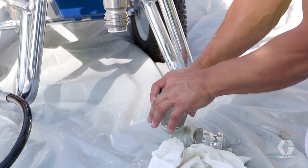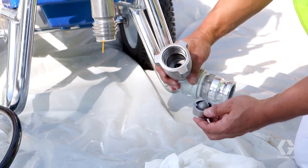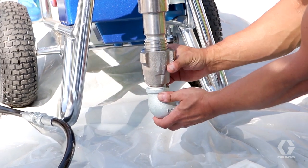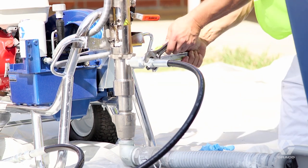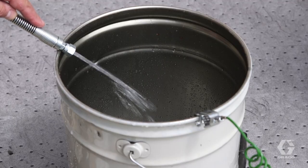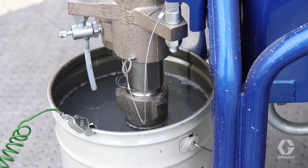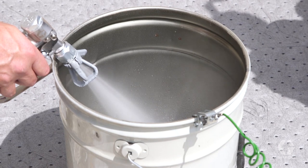For proper setup, first disassemble the pump lower foot valve and inspect it for residue and debris. Reassemble the foot valve, being careful not to damage the o-ring. Uncap the stored hose sections and attach them to the unit, ensuring proper torque, but don't attach the gun yet. Even a hose stored with virgin mineral spirits will have gelled particles of silicone inside, so pump fresh virgin mineral spirits through the pump and hoses until all clumps and residue have exited. Now attach the gun and pump virgin mineral spirits through the entire system and gun. Load material and pump out any remaining mineral spirits until material reaches the gun. You're now ready to spray.